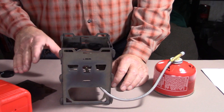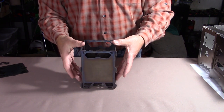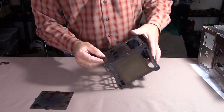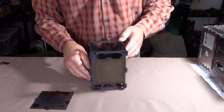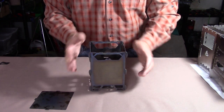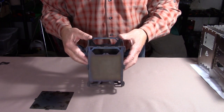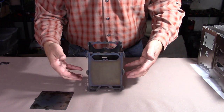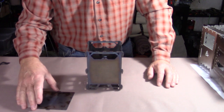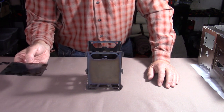Just before the comparisons, a few more comments on another option for wood use. I removed the ash pan and put the fire grate in the lowest position, which gives a little bit greater depth to the burn chamber for slightly larger pieces of wood — about a little over half an inch more. You have to be more careful placing the stove on a fireproof surface since the fire grate is now closer to the bottom. The benefit is you can get longer wood pieces in, and you're also reducing the weight of the stove by the amount the ash pan weighs.